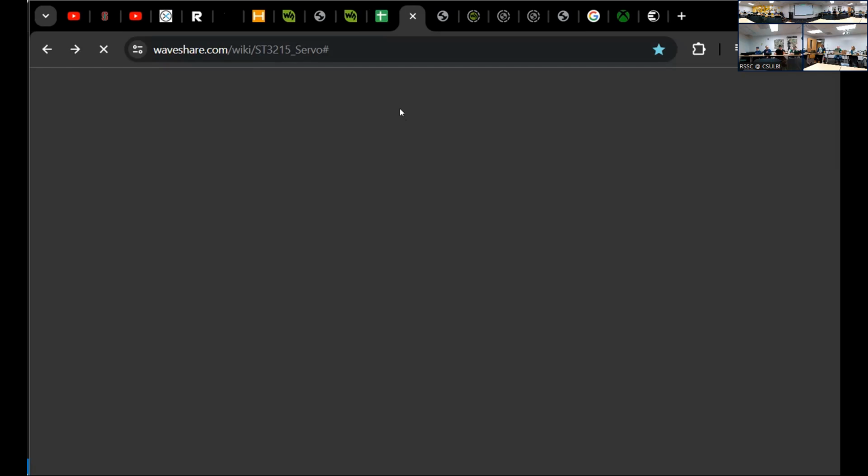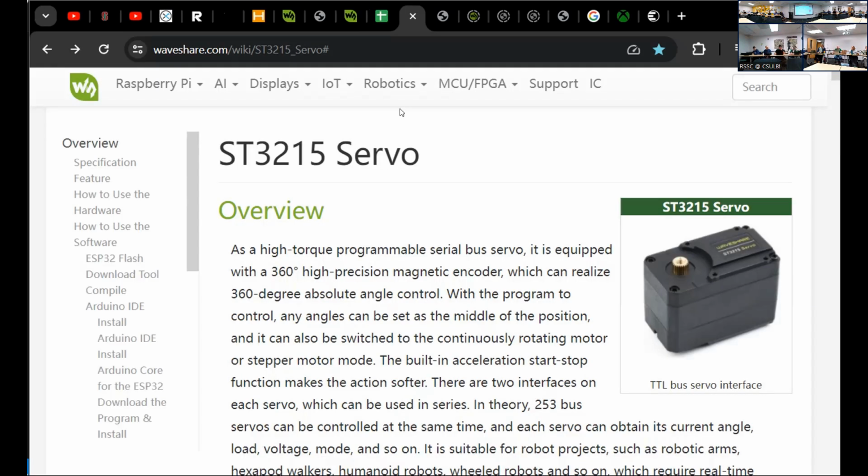I'm just curious, do they use continuous rotation with velocity? Yes. With the magnetic encoder versions like these, they are capable of continuous operation, so you have not only positional control, but also velocity. Okay, cool, because the Dynamixels had that, but there was a gap in the encoder, like about a fifth of it didn't have any encoder on it. It was kind of weird. Yeah.